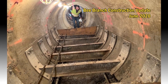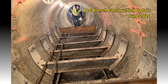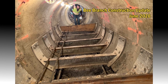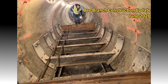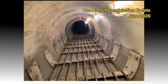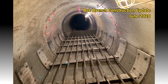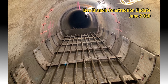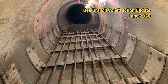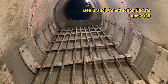The contractor had to go on the inside of the pipe to demolish it — at least the bottom part that would be in conflict. The challenge was that as you're demolishing the pipe, you're obviously removing its structural integrity, and the last thing you want is soil to fall down and collapse into the pipe itself. The work itself probably took a week and a half, but it took months for everyone to be comfortable with the approach so that it was safe.